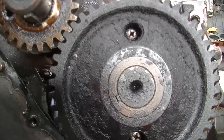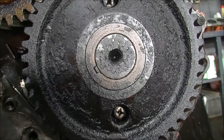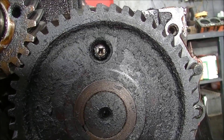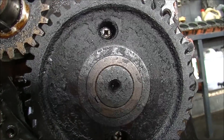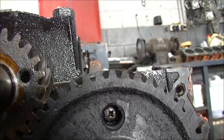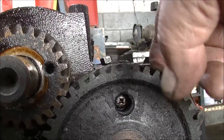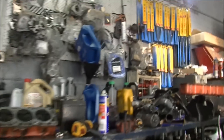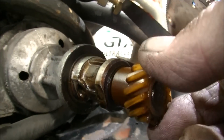When we look in, you'll see there's access for some Phillips screws, and we'll bang on them with an impact driver and pull the cam out. It still has the original fibre gear — that'll probably end up with an alloy gear on it. You can see there's a plastic gear on the distributor. They did all that to try and stop the noise.